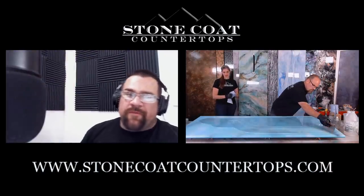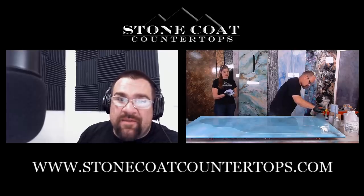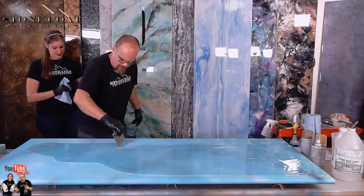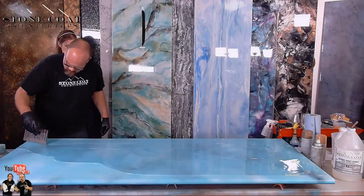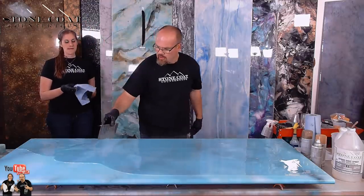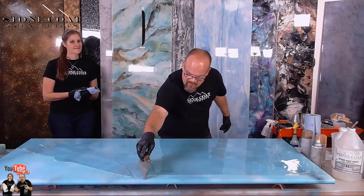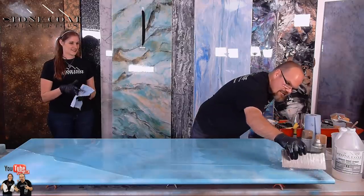Here's a good question about concrete garage floors: what should the moisture level be for a new home? The way that we test moisture is we're going to use a piece of plastic — tape it down, wait 24 hours, come back, and if there's any darkness from moisture building up where that bag was, it's too wet. That's a rudimentary way to test it and that's how we've always tested it. We actually go over that in our flooring videos.